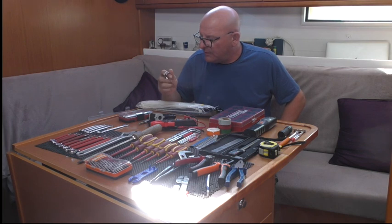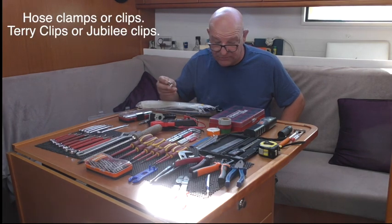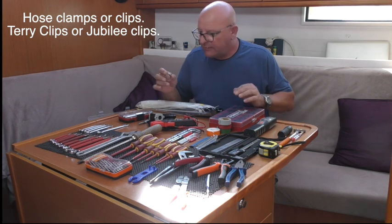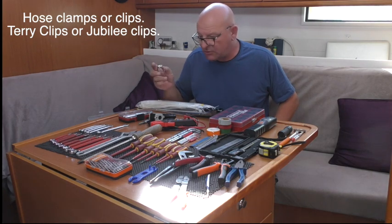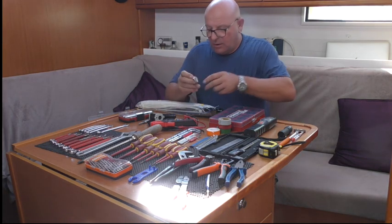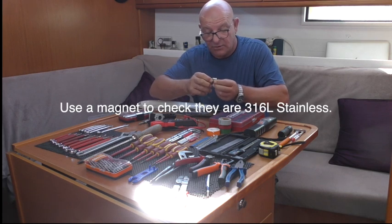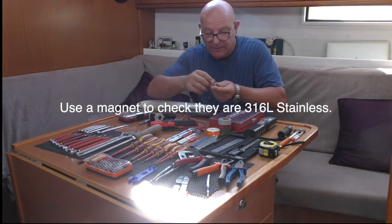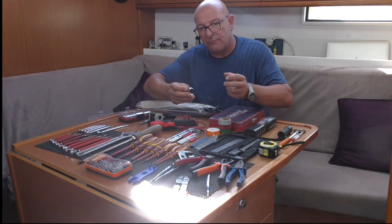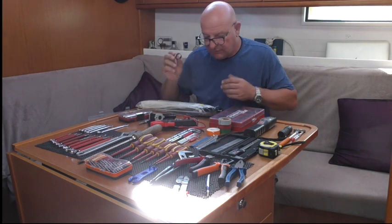We actually keep three of these in our go-to box. In the UK we call them hose clamps, some people call them jubilee clips or terry clamps - various trade names like Hoover for vacuum cleaner. We have three different sizes which we keep in the go-to box for if a hose clamp breaks or there's a leak. Always make sure you get stainless steel ones and that the screw is also stainless steel, and preferably the end that adjusts can be undone so you can put the clip around a hose without having to take the hose off.